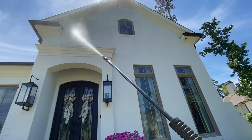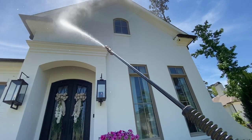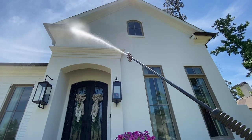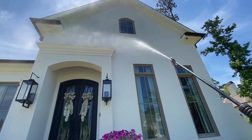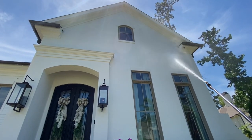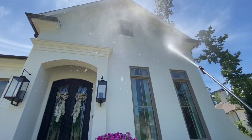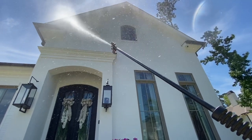If you have vents, pass over them rather quickly — you don't want to be pushing water into the attic. Right here I'm using probably about 60 to 80 PSI combined — very low. This is slightly higher than most water hoses, by no more than about 15 to 20 PSI.